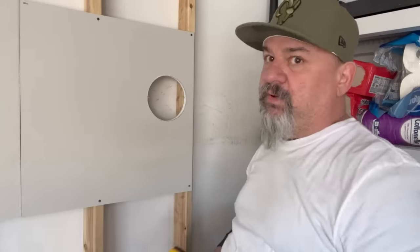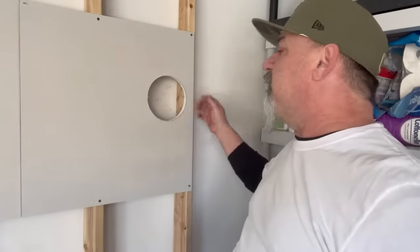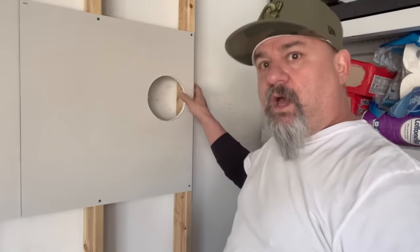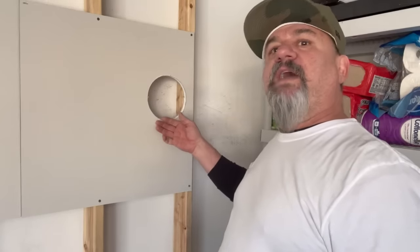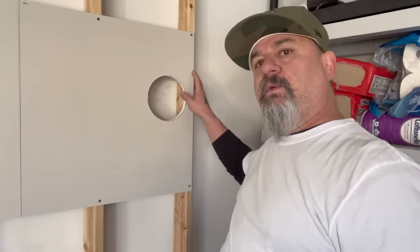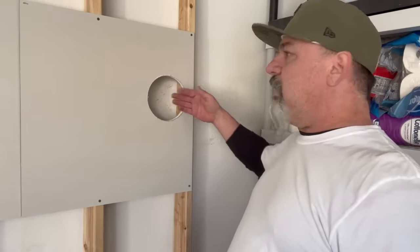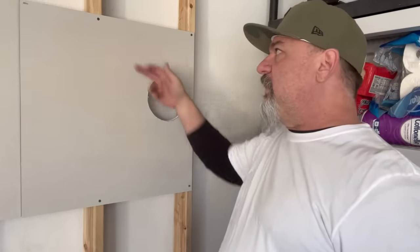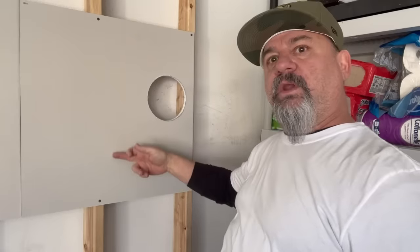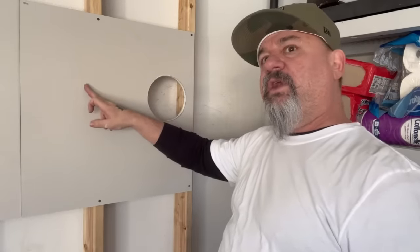Put it on low so it doesn't kick dust off all over. Maybe a friend — that taco companion we talked about in the other videos — can hold a shop vac to it so you don't get dust everywhere. Now we have our first hole. I can reach in there to the other stud and see if there is Romex running perpendicular to it. Then you're like, well, what about the other side — can you drill on the other side?